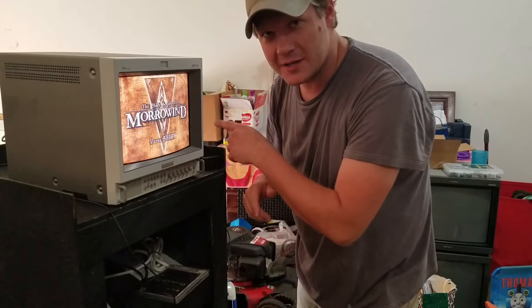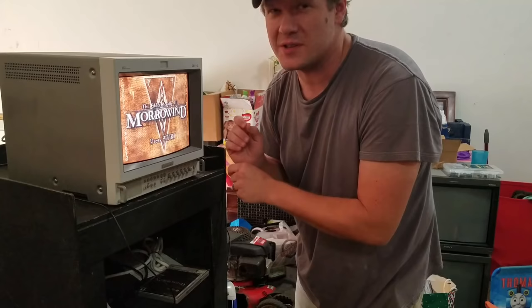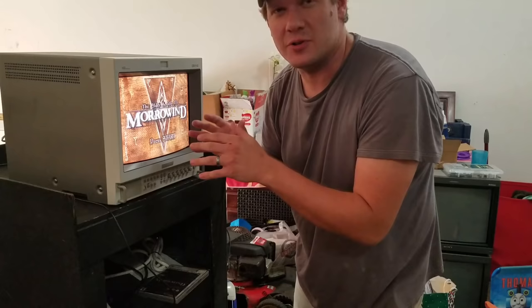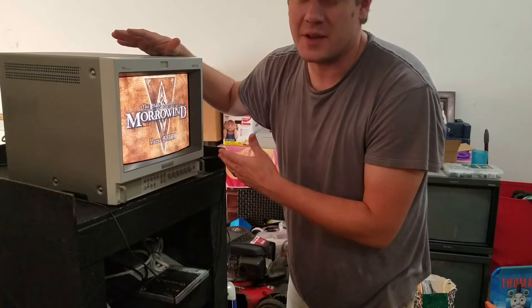And I really hope you've enjoyed this series. And look, I know people probably have a lot of questions. First off, I did this capacitor replacement mostly for maintenance, but there was a small issue with this thing where it would lose its settings on the pin settings, and it seemed to be affected by temperature, so I could tell that maybe those capacitors were going bad and letting too much or too little current through and losing their charge over time. I haven't had any issues with that since then, and it was really hard to catch on film. It would take hours sometimes to mess up, sometimes it would take 15 minutes and then it would go away. So it's never done it again since then.